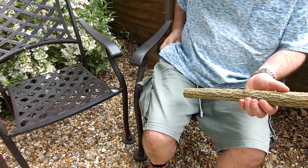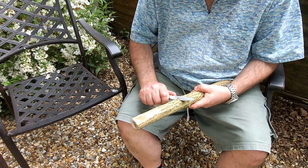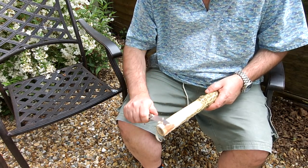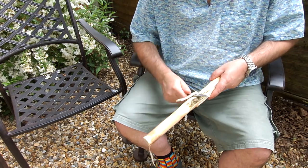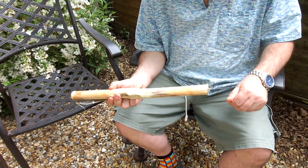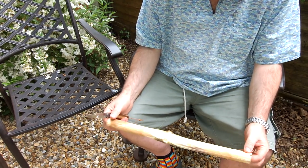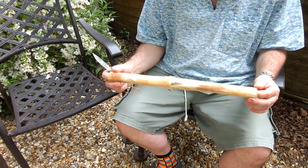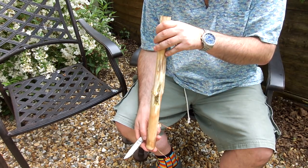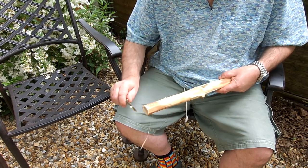What I'm going to do now to help it dry a bit quicker is take off the bark very carefully just with a pocket knife — just going to slice off the bark. Really I probably should wait and do this when it's dry, but it will take so much longer to dry if I do. We're nearly done now; I'm just going to finish up and then we'll leave that to dry somewhere in the garage. I was tempted to put it between centres on a lathe and try turning it to take down the thickness, but I think there's so little wall thickness there now and it's not perfectly straight — I think I would end up breaking through. And that was hard work drilling this so I don't intend to repeat it.